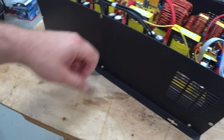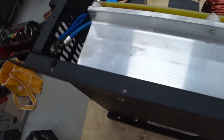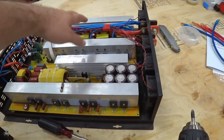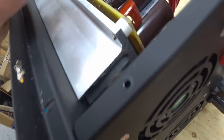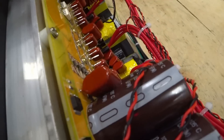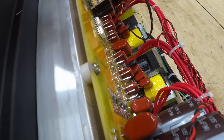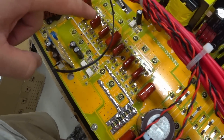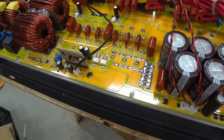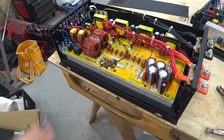Taking off one of the side plates, we can see a heat sink. The heat sink looks like it is one giant board — one massive chunk of aluminum instead of multiple separate heat sinks. The MOSFETs appear to be sandwiched between the aluminum heat sink and the circuit board, with their legs sticking up through the board where they're screwed down. That's an interesting and neat design. I'll put this back together and then hook it up to the battery to see what it can do.